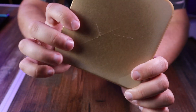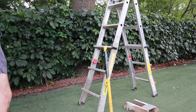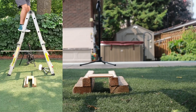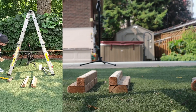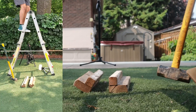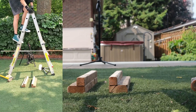The polycarbonate had no damage to the backside, so in this specific situation, the polycarbonate wins. Polycarbonate is known specifically for its high impact resistance, so I wasn't sure if the PEEK would do as well. I think PEEK overall is a stronger 3D printing material, but in this one specific test, polycarbonate wins. I suddenly had an idea for another test — let's drop a sledgehammer on it. And a pretty solid hit. In slow motion, it doesn't look like there's any additional damage, and it doesn't even look like the crack grew at all.